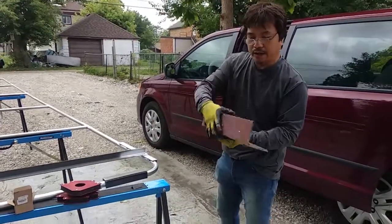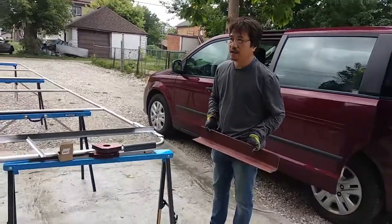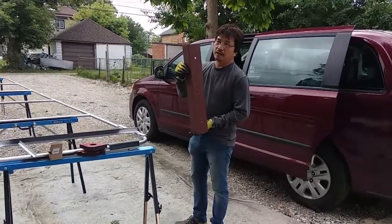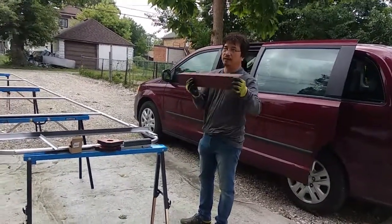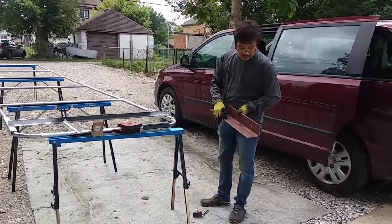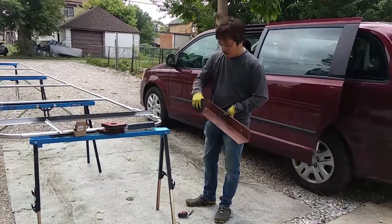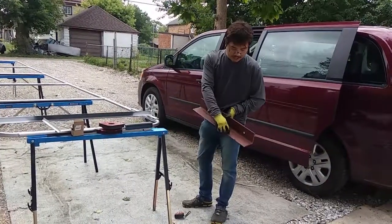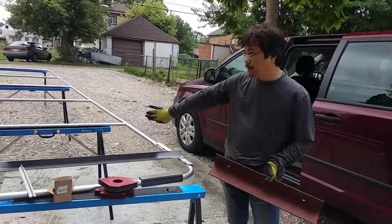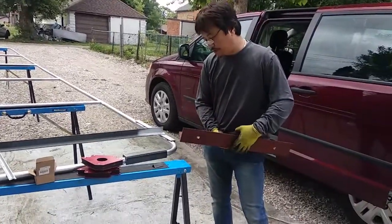The trick on this one is where we are going to use the central point to swing up and down. When this one swings up it goes 90 degrees open, and when it swings down to 0 degrees that's where the gate closes. After calculation and research, the central point is best at 18 inches from outside and 6 inches from the end of the gate. So we have this one installed like this.